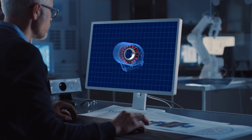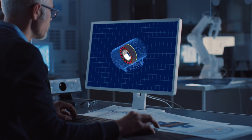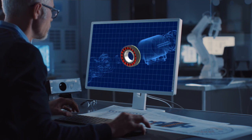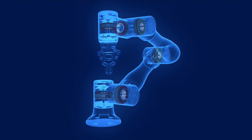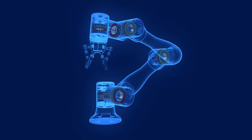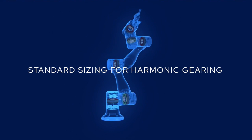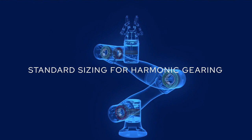The TBM2G is robot ready. The windings are designed to provide full performance with a maximum winding temperature of 85 degrees C. This lower winding temperature can help increase gearbox and feedback life, providing you with a robust solution.